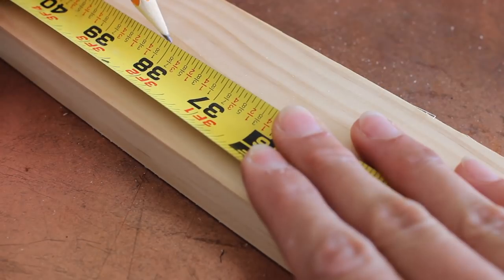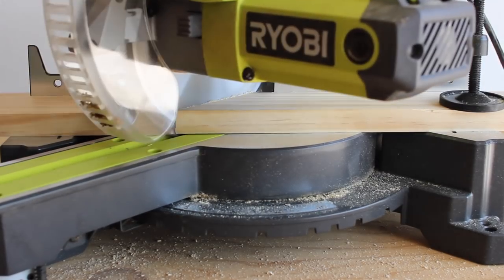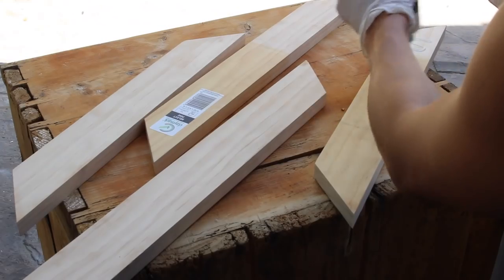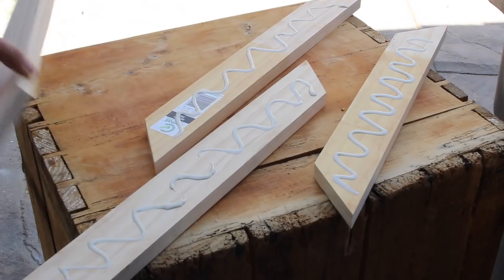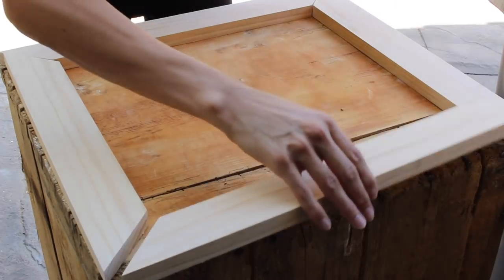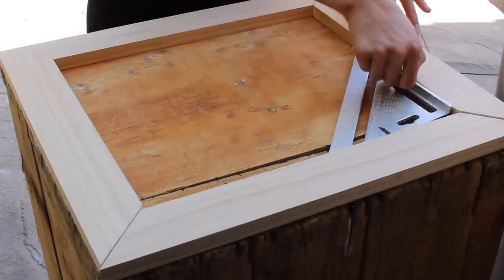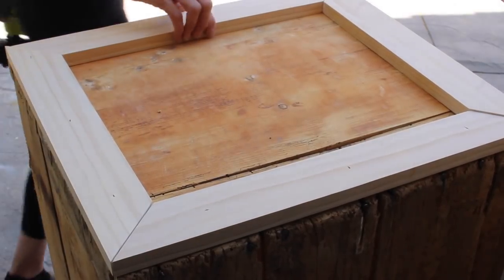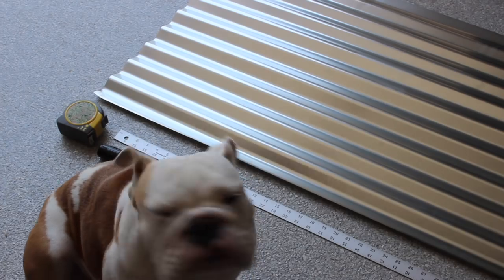Since the wood was too damaged to just paint as is — you'd be able to see all the grooves — I cut down four pieces of pine per outer wall at a 45 degree angle, almost trimming them out. I added wood glue before securing it to the surface and used my speed square to make sure all the angles were 90 degrees. I liked the look of raw wood, just not damaged raw wood. I also had to use my nail gun in some areas where pieces were a little wiggly.